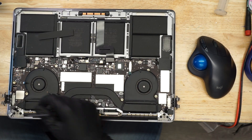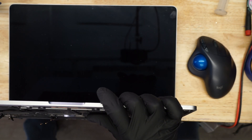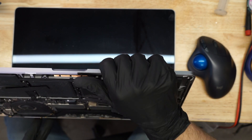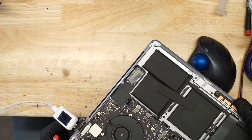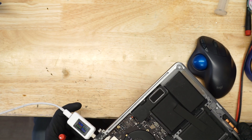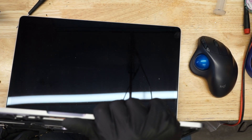These charge ports are annoying — how easily they come off. It's 1.2 amps — let's see what we get. It's taking 2.8 amps, which I imagine means it's charging. The battery is now plugged in and it says here on my USB-C amp meter 2.9 amps. So it is charging the battery — remember before I was complaining about the battery not charging.